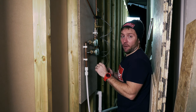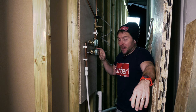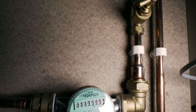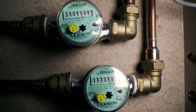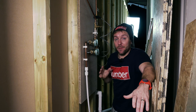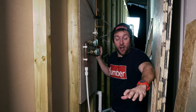The readings on these are in meters cubed. So what we're talking about is if you imagine a meter cubed of water. The IRC valve here used 0.582 of a cubic meter. So just over half of a cubic meter in 24 hours. Get this guys, the drip type, which is running at literally exactly the same flow rate and everything as the other one, was running at 1.483. So in 24 hours, it's used nearly a whole cubic meter more. So we've saved a whole cubic meter almost in 24 hours using the IRC valve.